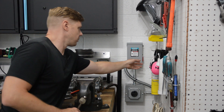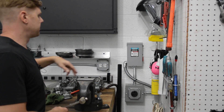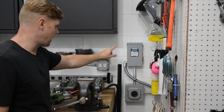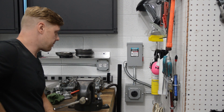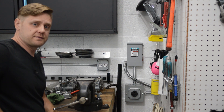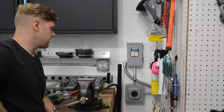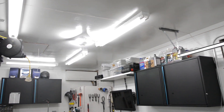It's perfect — it was such a pain to drag out that extension cord. I'll flip the switch real quick — there, that's on, that's off. I went with a big disconnect like this in a big box because number six wire is hard to work with — it's pretty thick and doesn't bend easy — so from experience at my old garage I wanted boxes that are a little larger and easier to work with. The total cost was probably six to seven hundred dollars. EMT sticks are ten bucks each, and I got 300 feet of wire which was about 330 dollars — three 100-foot spools. Nothing's cheap nowadays and electrical stuff definitely isn't, but you've got to do it right.